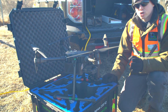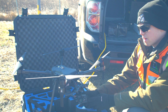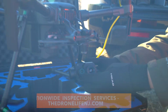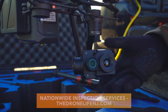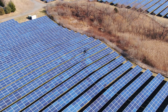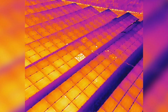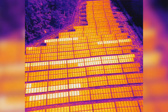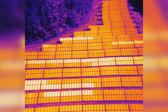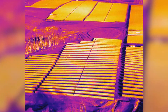The bread and butter of this inspection is the thermal camera right here. We have a thermal sensor and then a visible or RGB sensor, which is basically just a regular camera. When the drone flies over these panels, it can see differences in temperature of a panel that's not operating correctly or has some defects compared to one that's actually producing efficiently. You can see these differences across the entire farm and pinpoint the areas that are having issues.